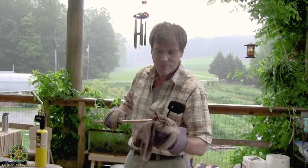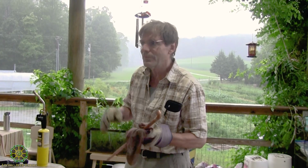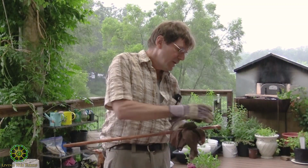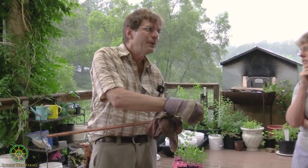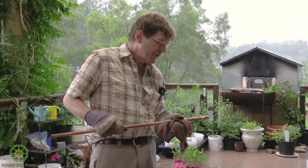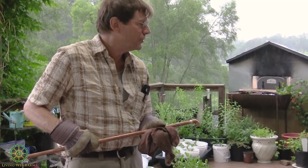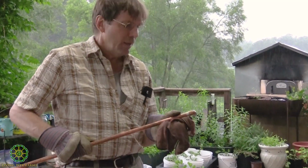If I stop doing it, it takes me a while, one or two, to get back into the swing of it. But we were knocking through them up there on the plumbing pretty quick on the solar stuff. If it was done incorrectly, this thing would be totally discolored, maybe even blackened, or very dark green, and it might even split. Usually it doesn't because you'll see that, but it could.